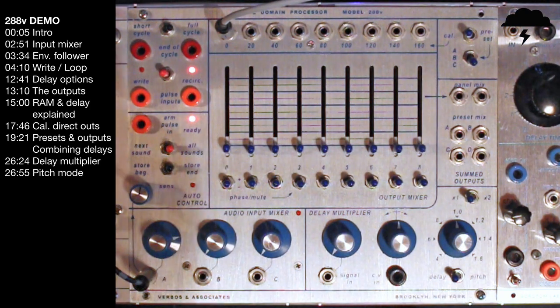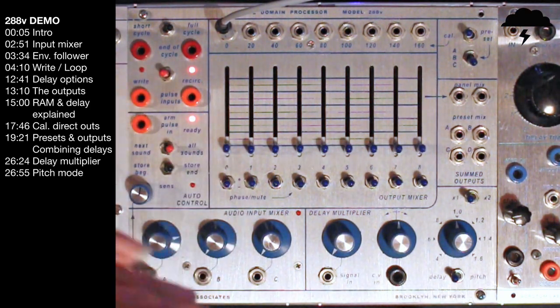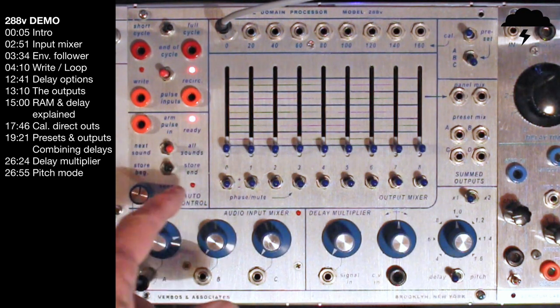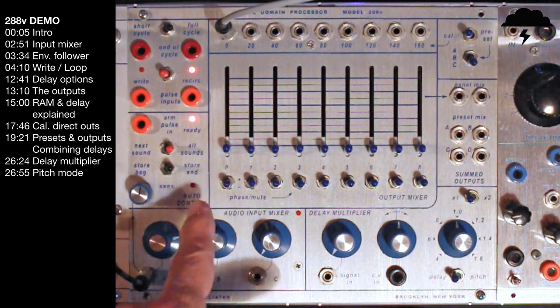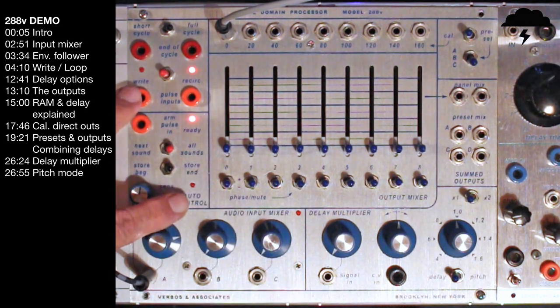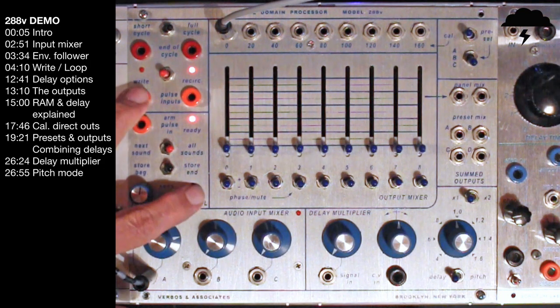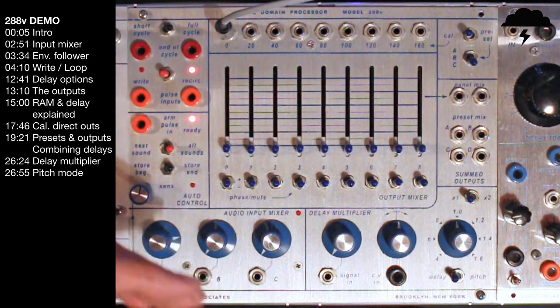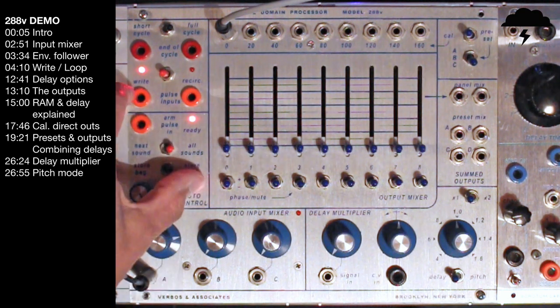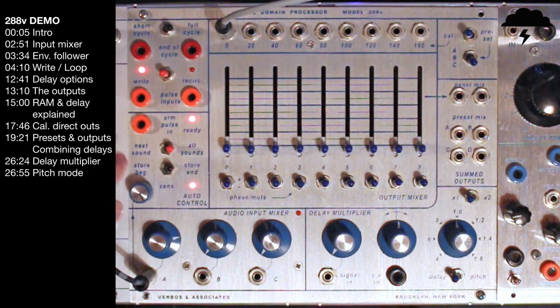It's a rhythm, so it's easier to get the threshold to have a peak which is high enough to engage an action. It's like a comparator here. I mean, it's an envelope follower and it sends a pulse to the right section, right, every time the threshold is reached. So if it's full on, it's always writing.